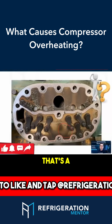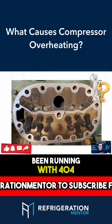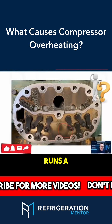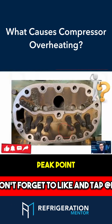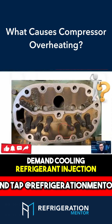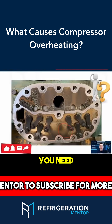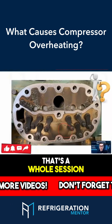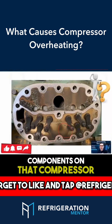Gas changeover retrofit — that's a huge one that most people don't know. This rack's been running with R404 refrigerant for 10 years and doing great, but now we just did a retrofit with R448 or R449. This gas runs hotter. It doesn't run as hot as R22, but it runs hotter than R404 or R507. And it breaks the peak point where you now may need head cooling fans, demand cooling, refrigerant injection, or liquid injection — whatever you want to call it. All these different manufacturers have different terms for them. But you want to understand that this new refrigerant may run hotter and you may need different components on that compressor.